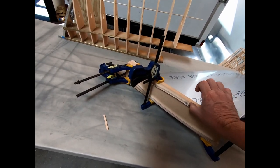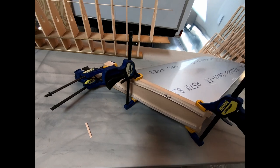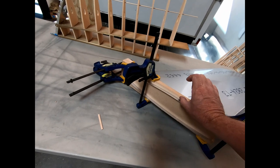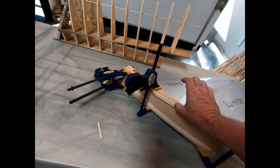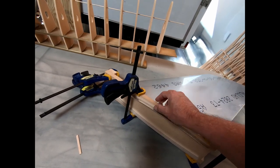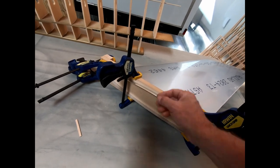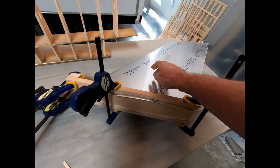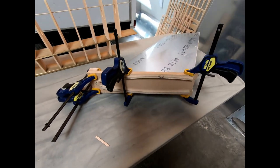I'm going to have to create some thicker pieces on the outside of here that are going to be a little bit stronger, because these aren't going to hold up to me pounding on them. But I just wanted to see if this was going to fit well enough and actually work. So I'm going to cut new outside pieces here that'll be thicker. What'll be good about using a thicker piece is I want to have it just long enough where I can put it on the edge of my bench, so that I can set this hanging off the edge of the bench with the MDF piece on top, so that when I start pounding this sideways and pounding it down, I have a surface that prevents this from slipping down the skin. If I have this hanging out the bottom and that flange is being held on top, and then I have this on top of the edge of a bench, I think I'll be able to shape that just fine.